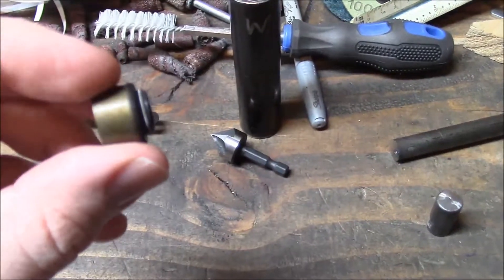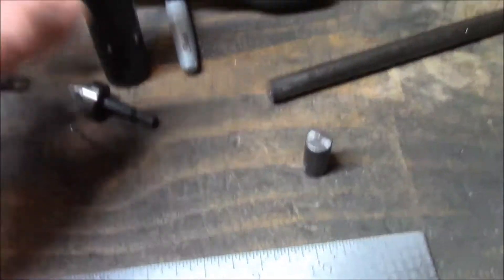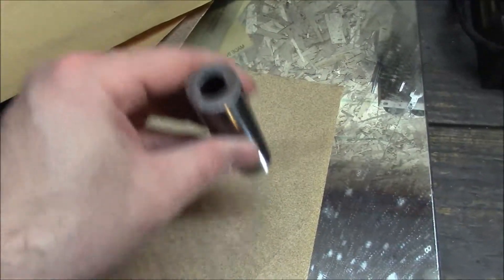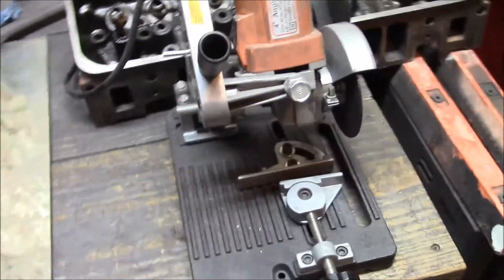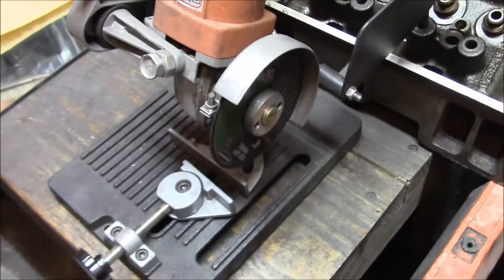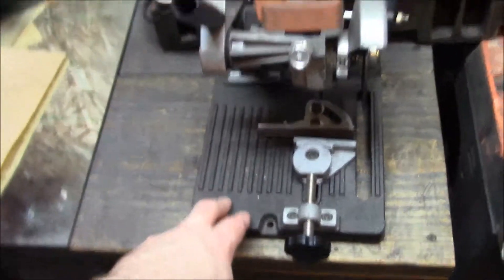Since the valve seal has a little bit of stick out, that's going to be actually inside the tube. This end I'm going to weld because it's rougher. The other end is a little better shape so I'm going to surface it over here with various grits — get it as smooth as I want. It doesn't have to be, but I want it a little cleaner. By the way, I use this clutch angle grinder adapter to cut down the rod — it's nice for little jobs. Supposed to use a five inch grinder but this is just a four inch. As long as you're using a new cut-off wheel it kind of works, and it beats digging out my full-size chop saw to make a lot of noise in the middle of the night. It's got a nice cast iron base — I'll include the link in the description.